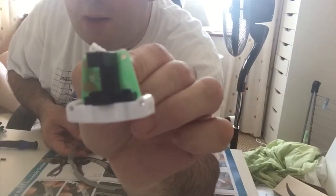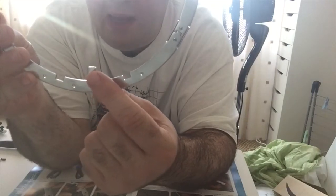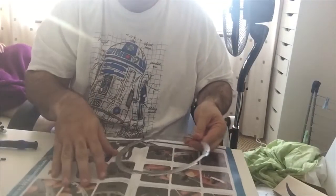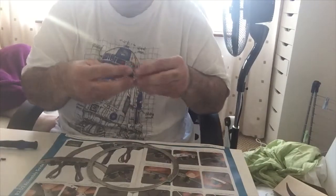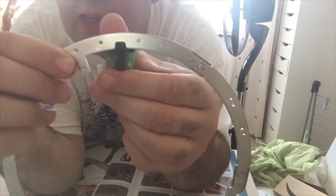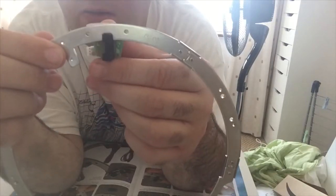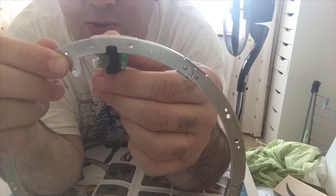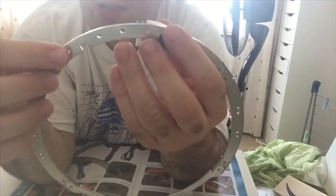That's the sensors done — sensors put in, both L and R. So you get the metal ring — see this jogged bit here. You put it on the table like so — that's the little screen. You get the left sensor, and see these holes on top here — this is where it gets screwed into the ring. You line it up like that. It locks in the slot there and you screw it in with 2.3x6mm screws. I'll do both of them off screen — one goes there and one goes there.